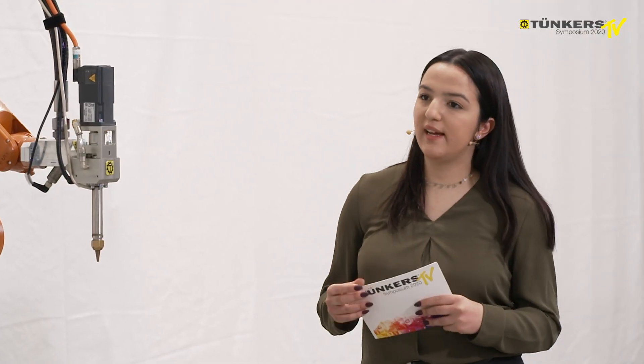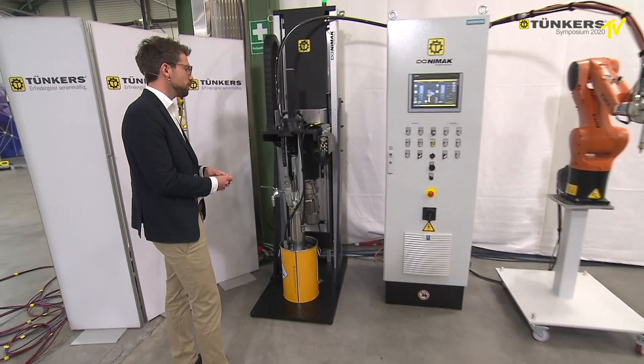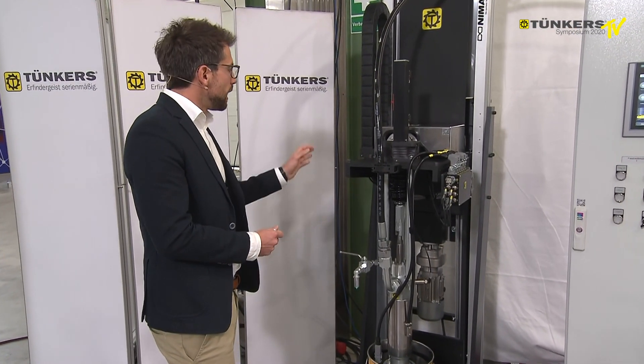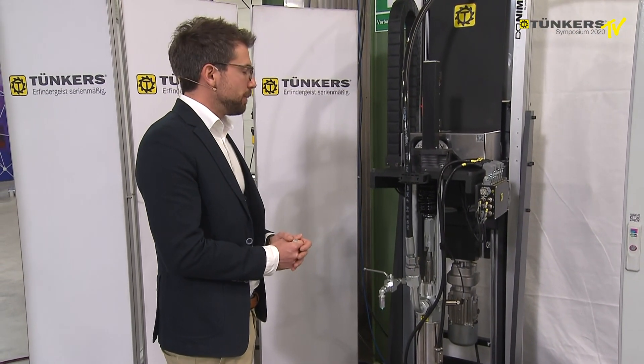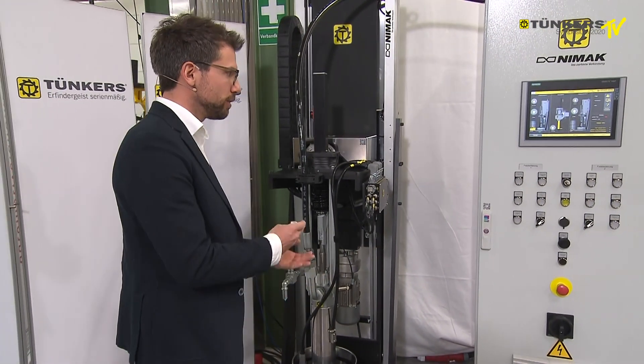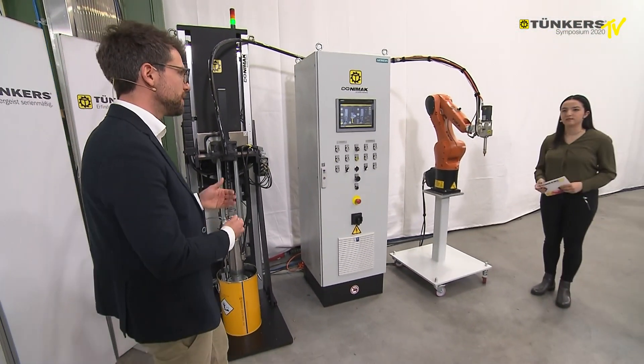And what are the current developments? What is an outlook? At present we are trying to develop a decentralized variant of the pump station, which means that there would be a small controller mounted to the pump station so that we would be compatible with other controllers on the basis of a defined interface. And a second development, which we are already making some tests with, is our own seam monitoring system, which will check not only the width and the height of the seam but also the position of the seam on the sheet metal.